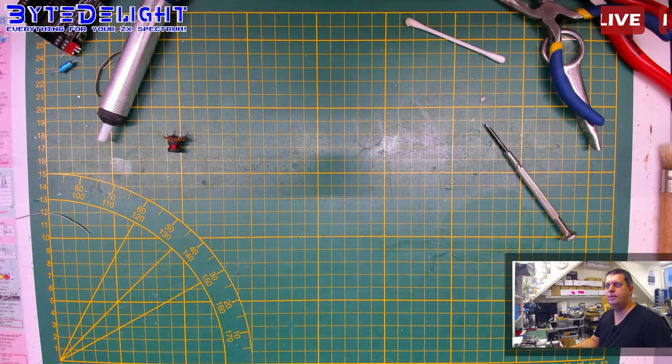I don't tend to replace the capacitors first. On some boards I do, like 48k boards with very old capacitors. But usually I want to find the cause of a fault first. But on some 48k boards, when I get low memory errors, I think it's important to do the capacitors first because there's a big chance that the capacitors are causing all kinds of voltage ripples, causing the lower RAM chips not to work, and I've seen it a couple of times. So replacing the capacitor sometimes solves those problems. Wouldn't be the first time.